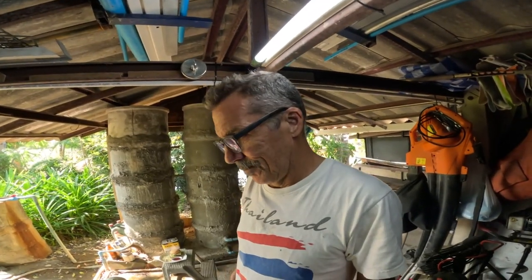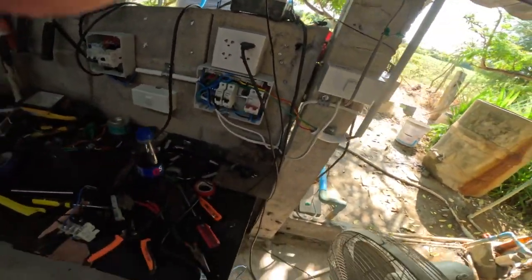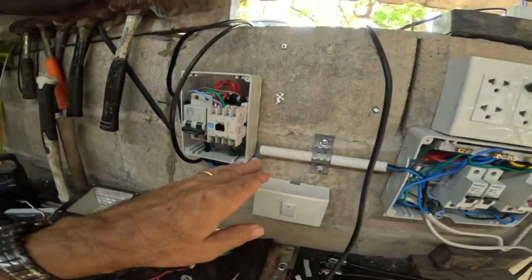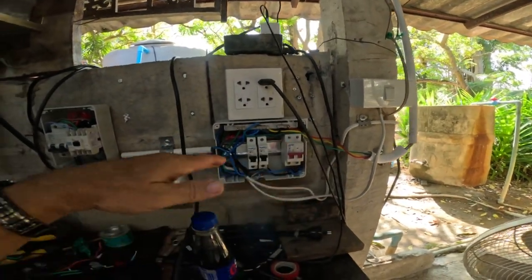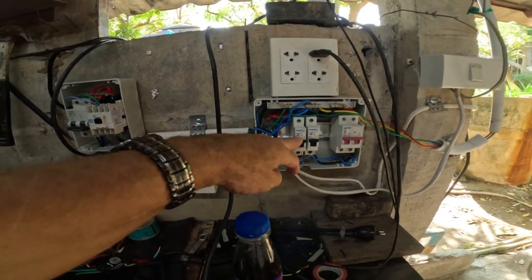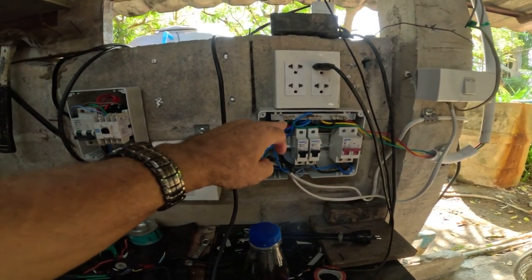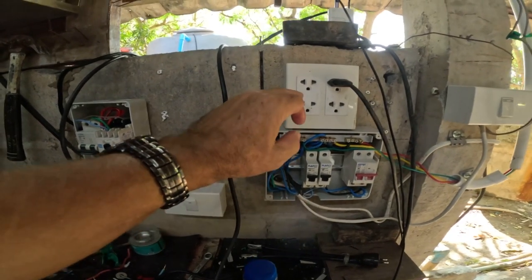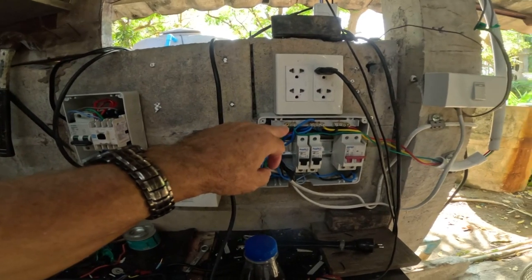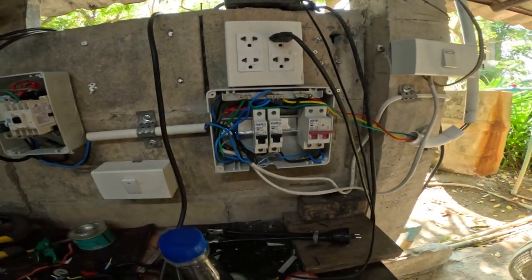Well, I'm almost there. I did get it kind of cleaned up. I think I got it figured out. So, definitely a lot better. What I really did was, this box was up here, but because I disconnected that, I needed to move the box over. I went back and got two 16 breakers. Patched that in, used the two bus bars it came with, and then I added a third bus bar. Actually, I took it from over here because I didn't need these. So I took one over here, made that a ground because I want this to be a grounded outlet. And there is ground coming from the main breaker box in the house, so I'll put that to good use.